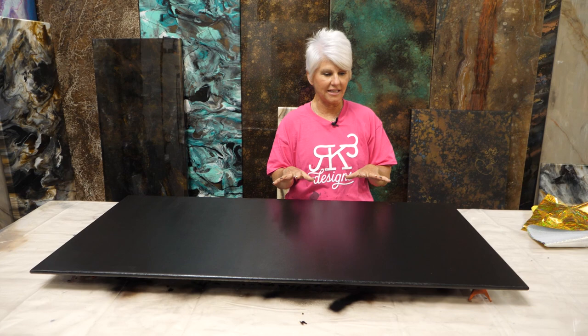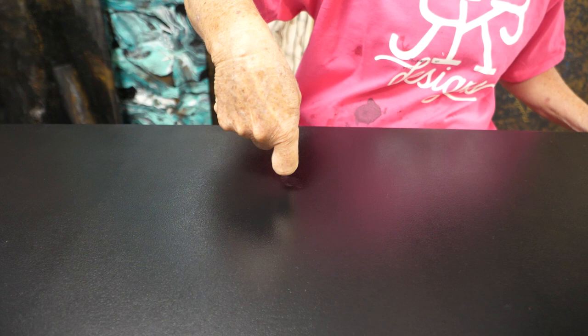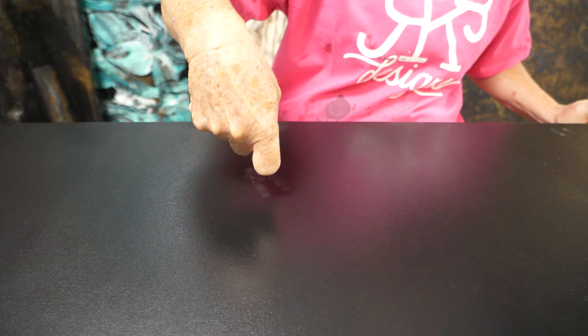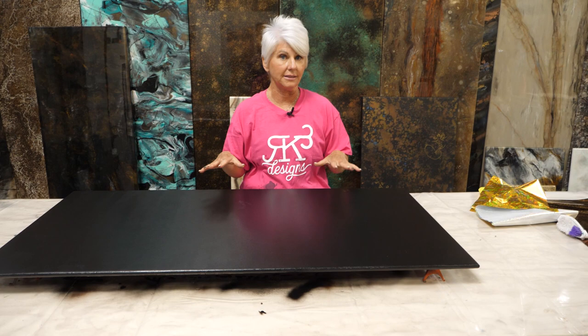You'll be fine. All right, so the adhesive has now set for about 45 minutes to what we call a full tack. The way you can tell if you're at the right timing is I'm able to touch the top, and if you listen, it makes a popping noise. And also, there's no stickiness on my finger. If this were not quite ready yet, if I touched it and brought it back, my finger would be sticky. So this is a really good way to determine if it's at the right time to go to the next step. And so it is.